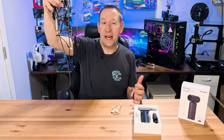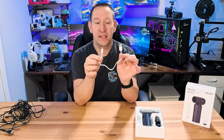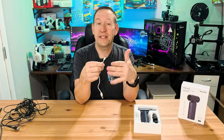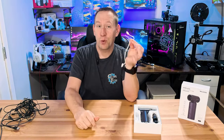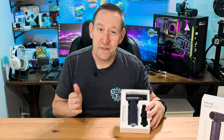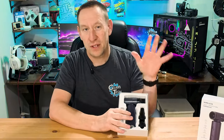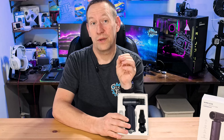Now if you're anything like me, you already have a tangle of cables. The danger in adding this cable to your collection is it only provides power — if you were to try and plug a device into a PC or anything that requires data transfer, this cable will not work. Whenever I find a cable like this, I break it in half and throw it in the garbage, because it creates needless complications. I don't fault Wilgo for providing only a power cable, since you only need power to charge the battery. I just would rather they spend the extra couple dollars to include a cable that also supports two-way communication.